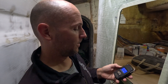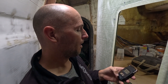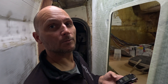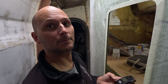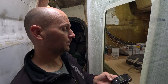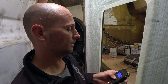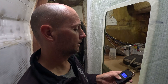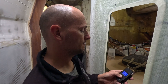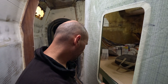Yeah, the hatches - well, the hatch is sub one kilo. So if that half a floor was 15 kilos, we could round it up and say 30 kilos for a full timber floor at the back end here. And now it's about 8 kilos. So that's a win - that's a big win. And this will be stronger than what that was, and it will be structural, because it will be laminated in now, whereas the old ply one sitting there wasn't even laminated - it was sat there with a few screws in it. The fact that we can laminate it into place now makes it part of the boat and makes the hull stronger.